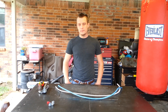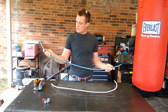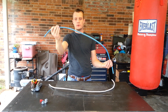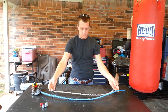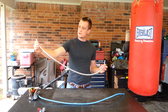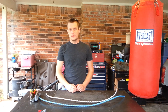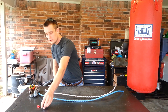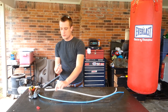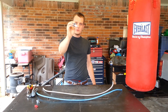There are two types of MC. Here I have a steel MC cable, and you know that it's steel based on the color — you can see that this is blue. And here I have an aluminum type, which is identified by seeing that it's silver. The reason it's important to know the difference is there are two types of connectors. Here I have a set screw connector, which is for the steel type and cannot be used with the aluminum. For the aluminum cable, you have to use a compression type fitting, which I have here.